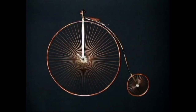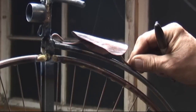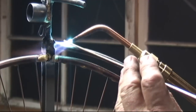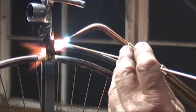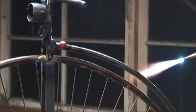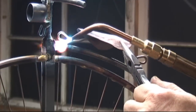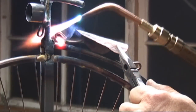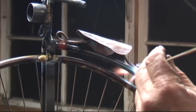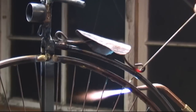Something just a little bit different with this seat for the high wheel bicycle. The first thing I'm going to do is figure out exactly where I want this. I'm going to put a Daba Bronze right there for the first braze. Holding the seat with the bracket — the bracket's attached to the copper seat. Melting the bronze. Now I'll come down and do the lower one, just holding the rod in my left hand and the torch in the right hand.